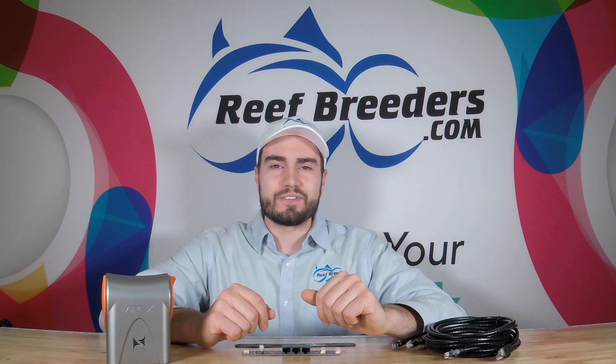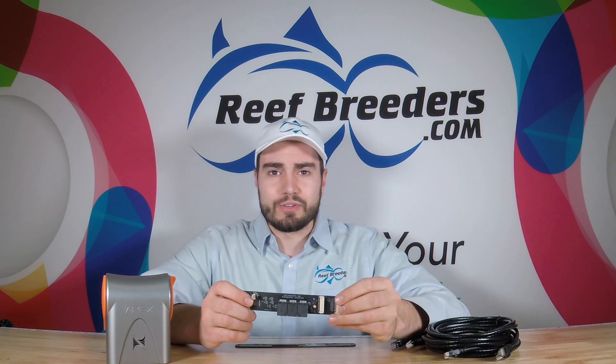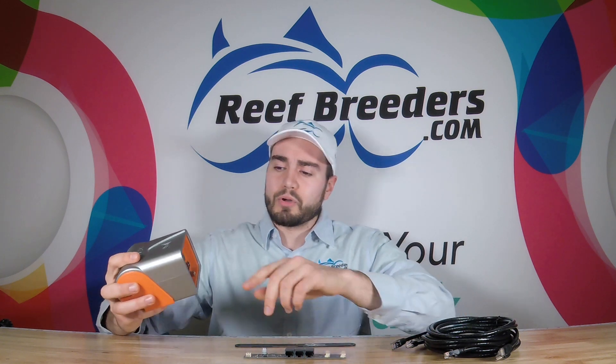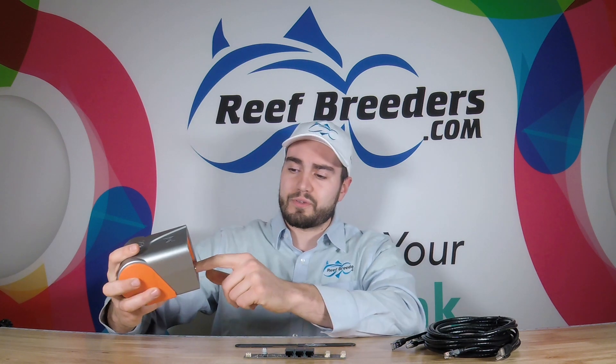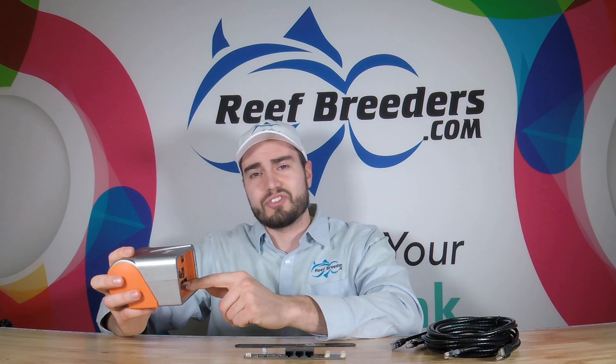The Photon Apex Control Interface replaces the default controller in your Photon V2 or V2+. It includes three Ethernet jacks which are designed to work with the Apex's VDM. On most newer Apex's, the VDM slots are located here. They will have four green indicator LEDs and two RJ45 Cat6 Ethernet jacks.